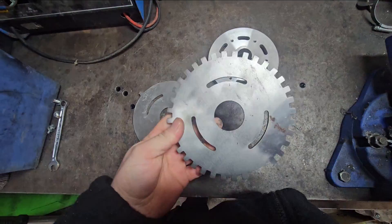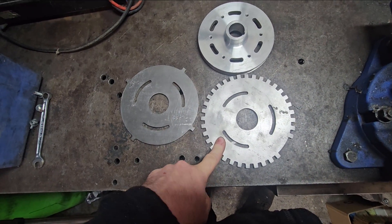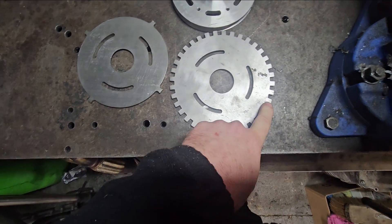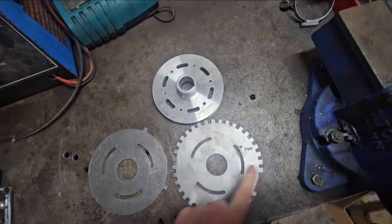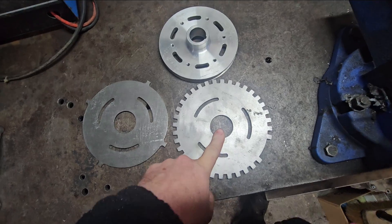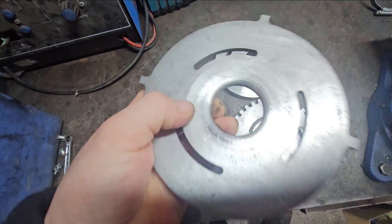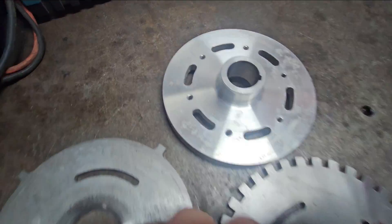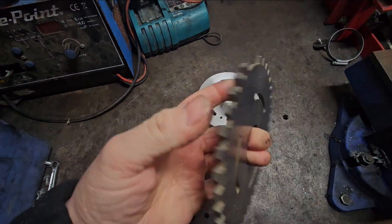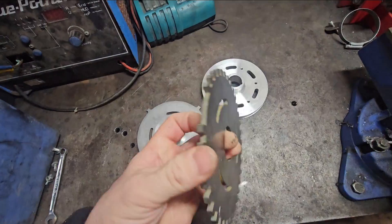Okay, lovely. Steph has water jet cut this new wheel. You can see how many more teeth it's got, and it's got this missing tooth arrangement, so that it's got an actual position rather than a generic 90 degrees. Really pleased. The only thing I've got to do is on this it's got a chamfered edge to sit against tight. So we'll go and use Jam Jam's lathe and just tickle that out so it fits, and we'll get it bolted back in.